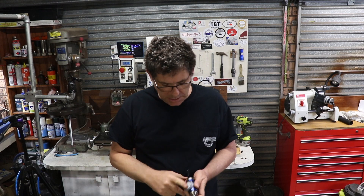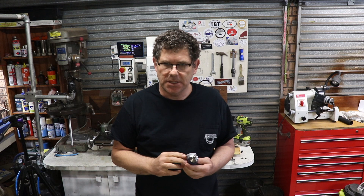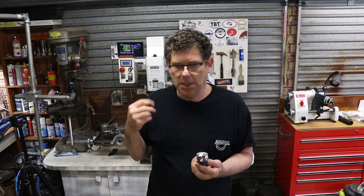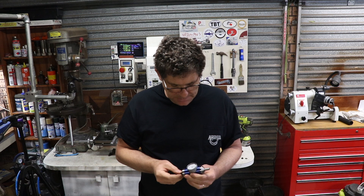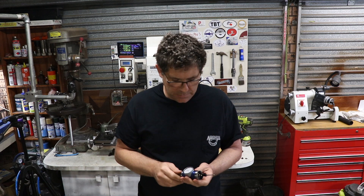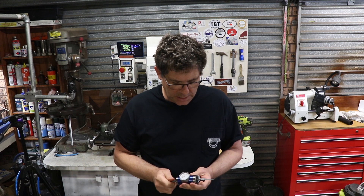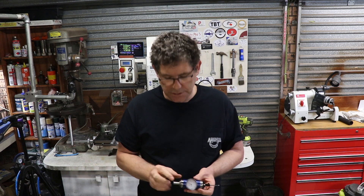In summary: a very useful tool. It's fast to find the center of a hole, and it's very nice to be able to look directly at the gauge and get things lined up. Using a test indicator clamped the old way, you're looking behind it and it's very annoying and inconvenient. I found it was about three times as long to set things up that way, and I ended up with the same accuracy - the two methods were equivalent.